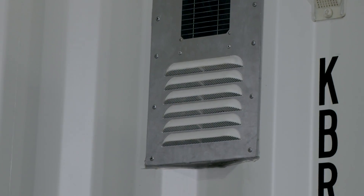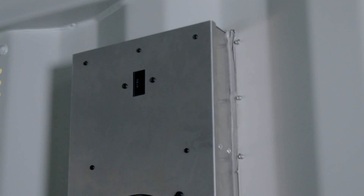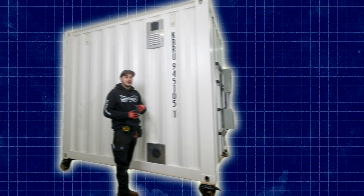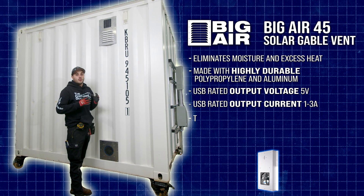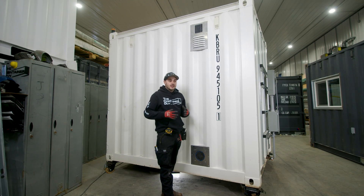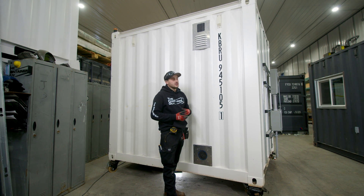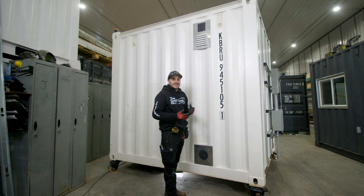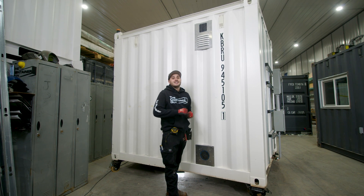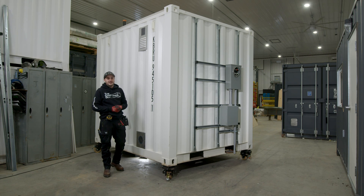These things are awesome. They've got a five-volt solar panel on them which runs the five-volt axial fans. There's a fan on the interior shroud that constantly circulates 54 CFM of air when the sun is hitting the solar panel. When it isn't, it still acts as a passive vent and can ventilate throughout the nighttime. But usually most of your heat problems happen when the sun's beating on your container, so if you install it on a south-facing side in the northern hemisphere, you'll have constant airflow circulating through the container while still getting passive benefits at night.